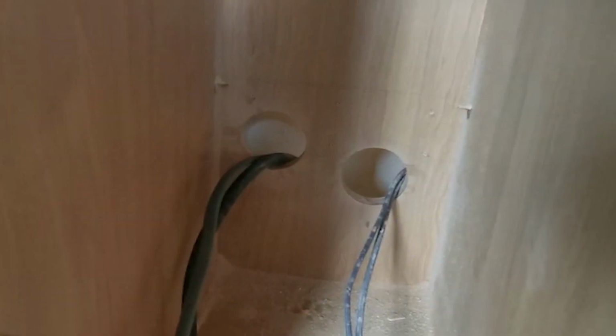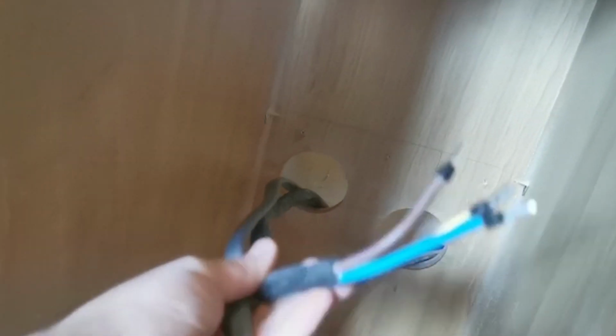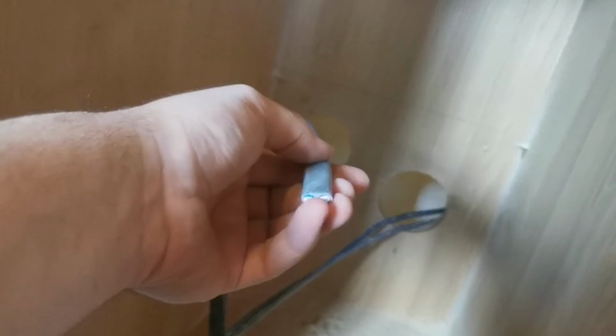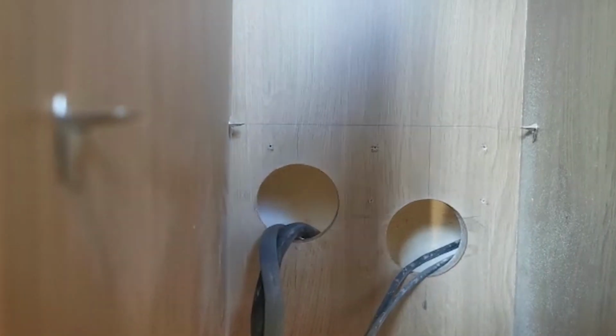That's those cut out and the cables passed through, so that'll go into your socket. You've got to get the cable through which does the extractor, get a plug top on that and plug it in. And then we've got this big 6mm heat resistant flex from the Aga, and then we've got some 6mm there which will power up when we connect into the fuse board. So there we go. What we'll do is get it second fixed, get your boxes screwed back, and then that'll be this bit done.